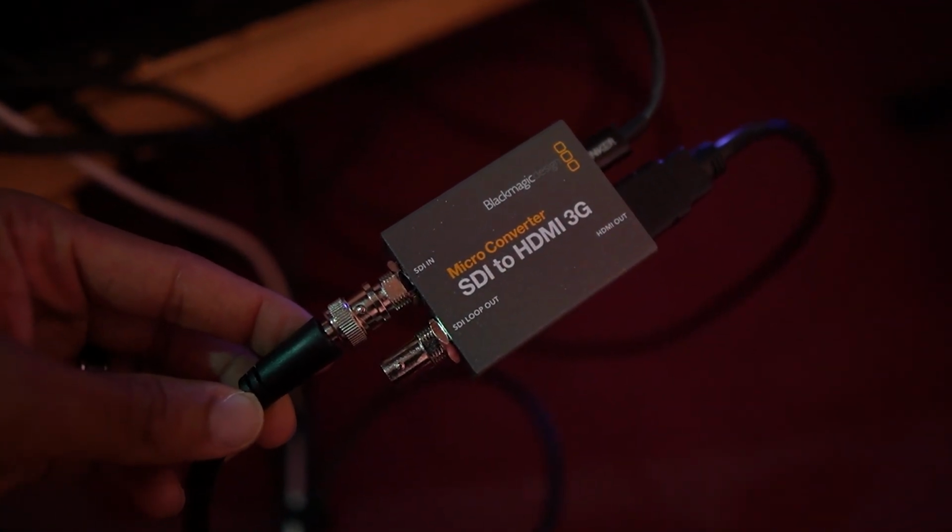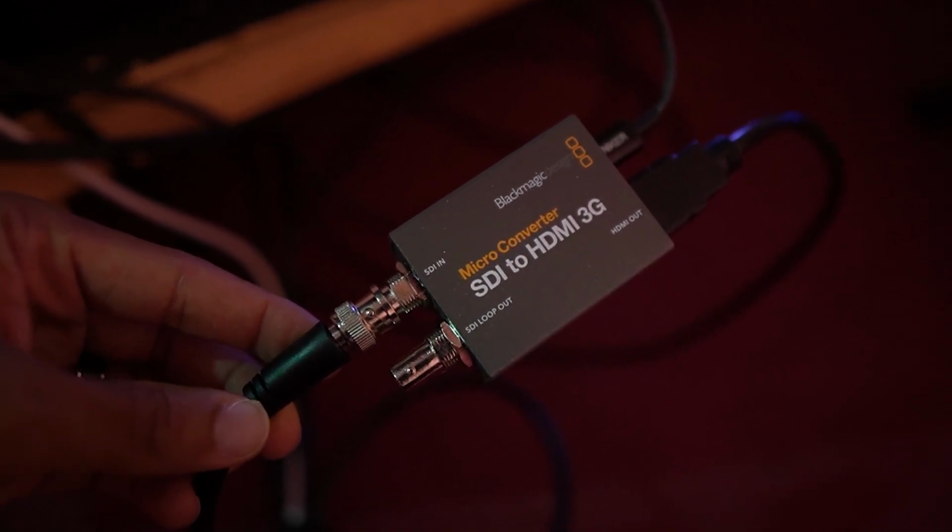And then I had these media converter boxes. Because we weren't getting a signal into OBS, I thought maybe it was the media boxes that I bought. However, I just swapped those out with Blackmagic media converters, and the signal when I tested it the other week was intermittent. So I'm going to turn on the camera against the back wall and see if we're still getting intermittent, because I definitely don't want that. But I do have the solution with that long cable, which was brand new to me, which AJ had mentioned in one of his videos about a one-way HDMI cable. I like that concept because it eliminates unnecessary equipment, and that helps in any troubleshooting. So that may be the solution for this setup. So let's get to rocking.